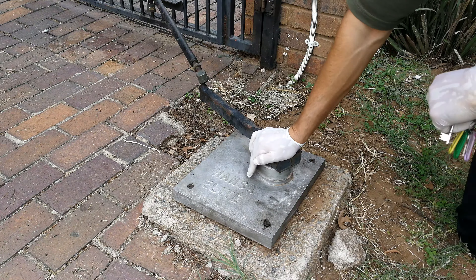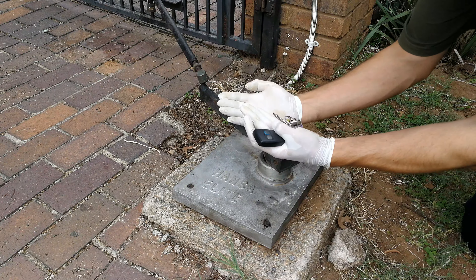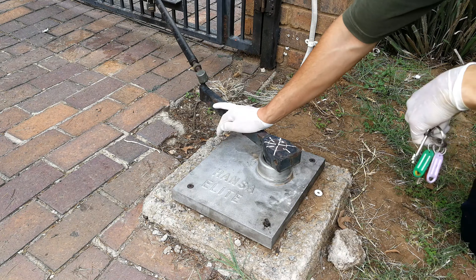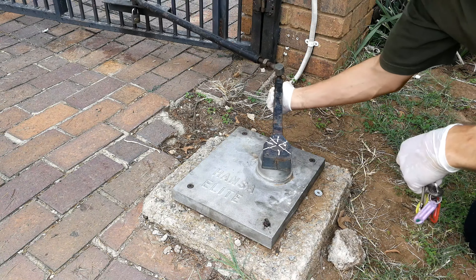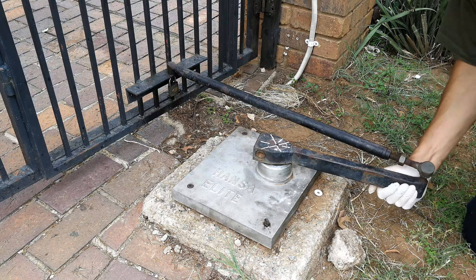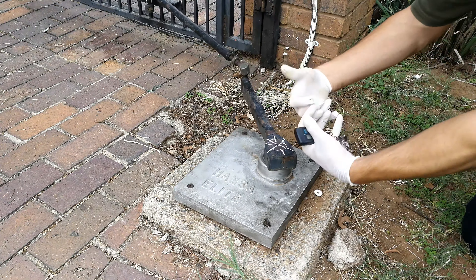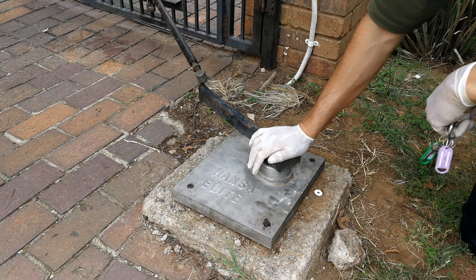I've been using this for a few days. Excuse the alignment marks — that's just to make sure the one gate closes first so the mag locks engage. Now look at the outcome of this repair: I'm going to open the gate and you can see it's got no free play — very good. Towards the end of the travel there's a little bit of free play, but look at this arm — those teeth are now very close into that worm gear. The brass gear and the worm gear are actually meshing closely, so that solves the problem.